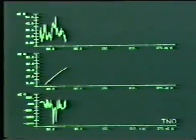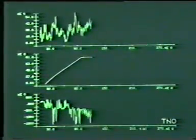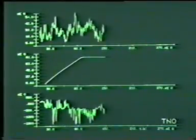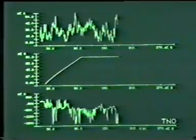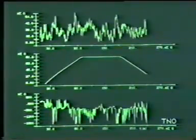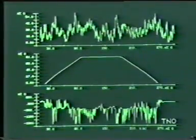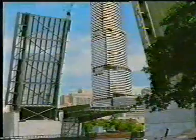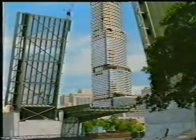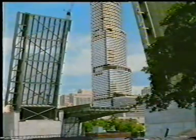Assuming a speed controlled motor which produces loading as shown in the centre, which results in loading on the drive superimposed on the dynamic loading due to moving the bridge. The lower graph shows the result of such a simulation. With rigidity, buffers, masses and dampers as parameters and a random wind loading, the instantaneous motor torque is calculated. In very windy areas, reduction of wind loading can be achieved by constructing the deck as a grid. Wind loading is a factor not to be underestimated, also in other types of moveable bridges.